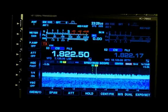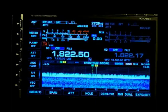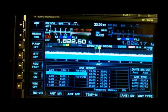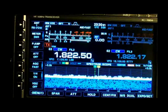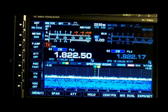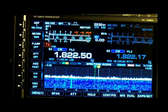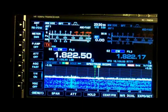This is my ICOM 7851 and I'm listening on my transmit antenna, which is a quarter-wave vertical with radials underneath it mounted on the ground. Right now the noise level is S9. Now I'm going to switch — this is my magnetic loop and the noise level is between S3 and S5. And now I'm going to switch from the magnetic loop to the Waller flag which is vertically polarized — and you can see the noise is down quite a bit, down to S2.